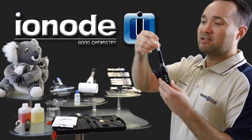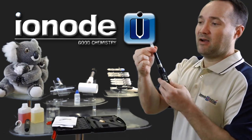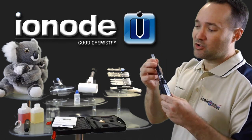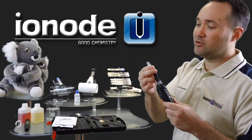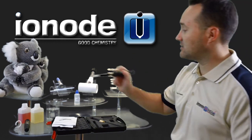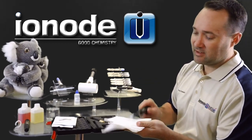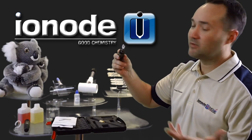Once we put that in there, we slowly nudge this back — I do a little twist until I get it seated. How do you know when it's seated? Once your O-ring passes this little black lip, it's seated well enough. You want to push it as far back as you can, but if it's giving a little resistance, it's okay. The next day after using the electrode you'll have a little bit of electrolyte creep coming out of the end next to the glass. Put that in a little bit of water, swish it around, tap that off, then using a paper towel, pat dry. Get that water out of there as best you can — and you can see that excess is gone. You're in good shape.